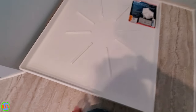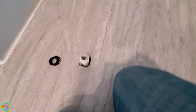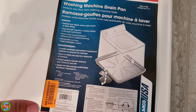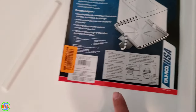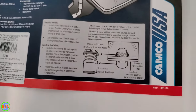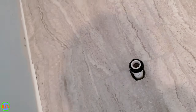Here is the drain pan itself, and my drain tube is going down right below here. The drain pan typically comes with your initial connector, which this one did — I will link to one of these in the description below so that you can order the right one. There are oversized ones designed to fit a front load washer or dryer, and that's what this one is. This one's a 27 by 30 inch, and the sides are 2⅛ inches high. Right here is the connector for connecting it to a 1 inch PVC drain line.